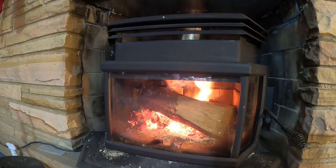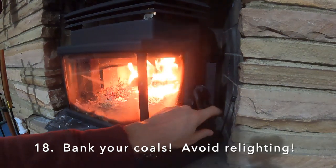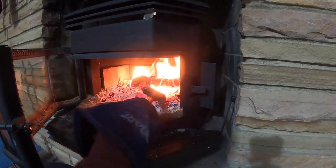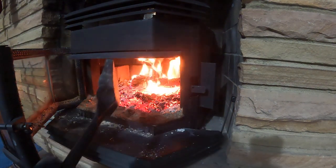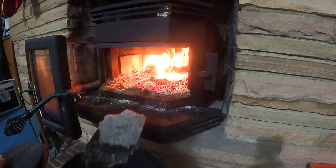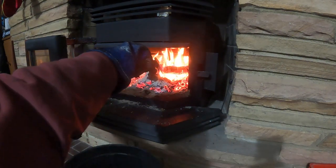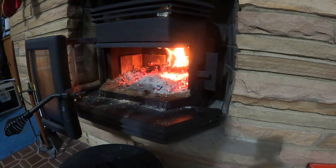This last thing I want to cover is banking coals — you can do this to avoid having to light a fire the next morning. Once the fire has a good bed of coals, choke the air control all the way down. To bank, take your shovel and scoop all the coals into a big pile in the front of the firebox, then take your ash bucket and cover the coals with ash. It seems counterintuitive but you basically starve them of oxygen and keep them really hot. Tomorrow morning you should just be able to put some kindling on here and the fire should start without needing a fire starter.